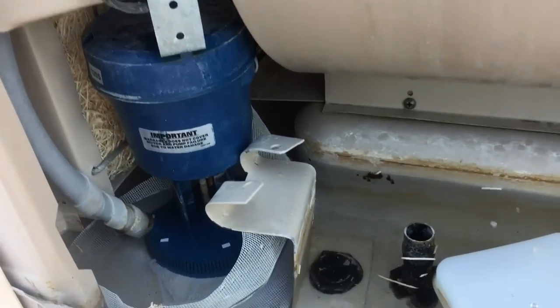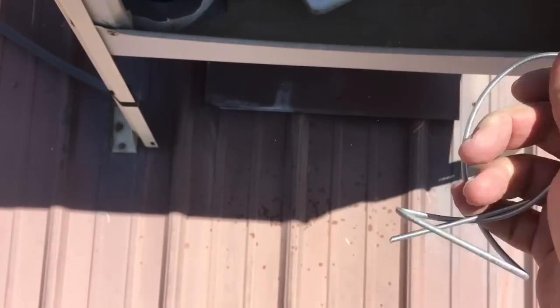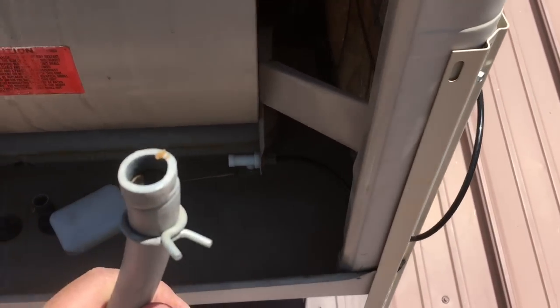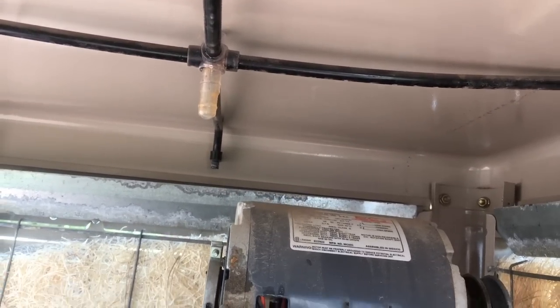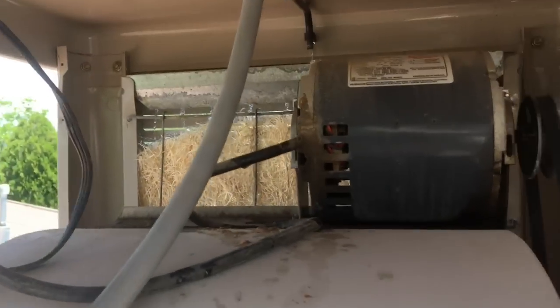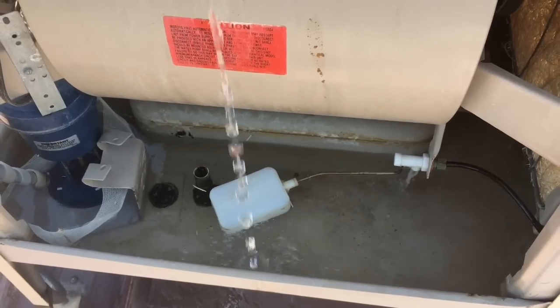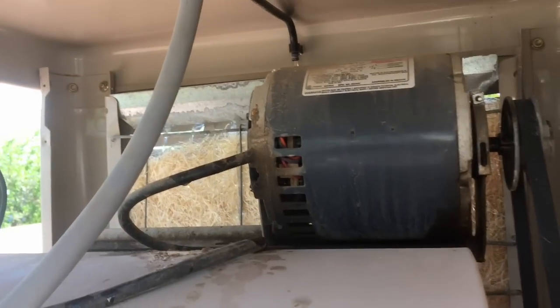I turned on the AC on low - the pump is going, the motor is going, the fan's going - but there's no water really coming out, it's just dripping. Something's plugged. So I get my little drain tool - a spider rotor router - and run it up in the spider to try to clean it up. I found the problem: this was plugged, and so was that. This little guy was full of a bunch of crap. Got it out, reconnected it, and tried it again. Fixed it - water's coming out of all of them now. The only problem with aspen pads is they do clog things up. You've got to be able to clean out your spider and understand you can take it apart and buy new ones if you have to.